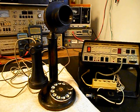We're going to install a cloth receiver capsule cord. We also want to troubleshoot the receiver capsule. We also want to install a cloth line cord. This unit has the original diaphragm transmitter, but that will need to be changed. Install an electronic amplified transmitter that we design and build here at the shop. We want to go through the rotary dial. It needs to be cleaned, oiled, and adjusted. We also want to install a dial center card and ring for the finger wheel of the rotary dial. So we'll take care of that issue.